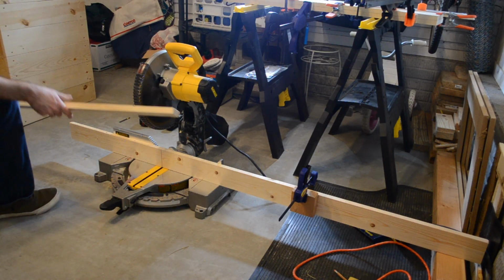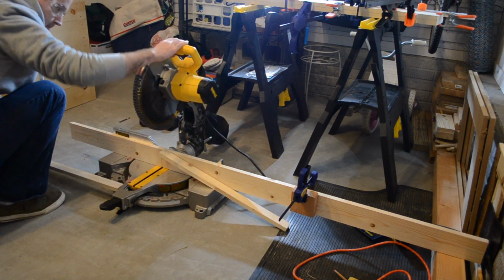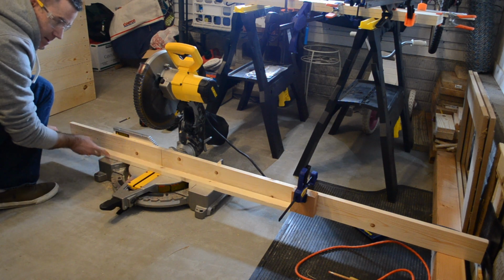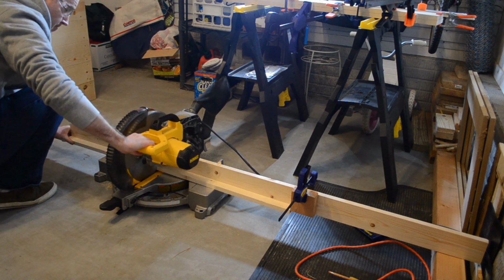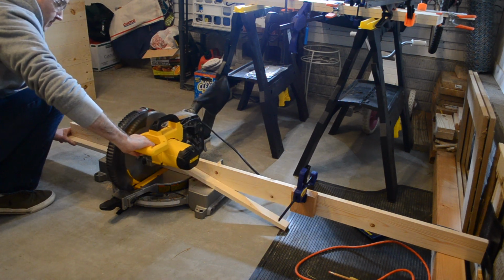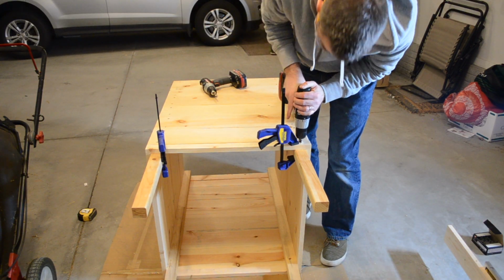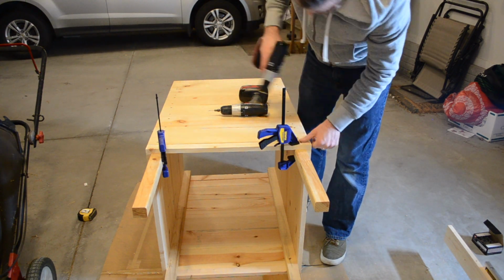Since the tower will start off with only one of the 1x6s attached at the bottom of the tower, I decided to cut some 2-foot pieces of 1x2s for the top of the tower. This will allow the tower to hold its shape while not blocking too much of the sunlight. I again pre-drilled holes with my countersink bit and then screwed these down.